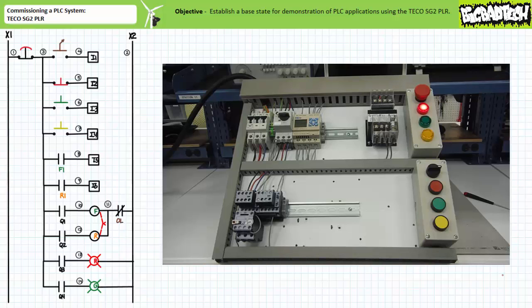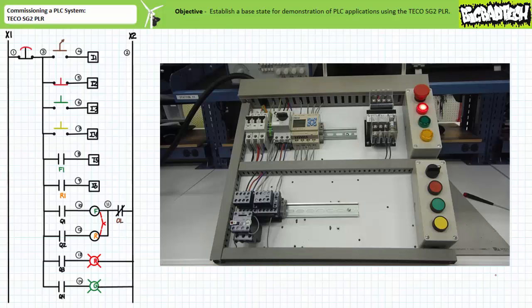Let's now test the functionality of the e-stop. When the e-stop is actuated into the open position, the PLC should remain powered up and the status screen should indicate no input or output is energized regardless of how vigorously or frequently they're poked, prodded, diddled, or dorked with. That's the point. The e-stop has severed all incoming and outgoing communication to and from the PLC without the necessity of relying on a programmed instruction to do so.